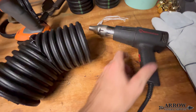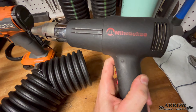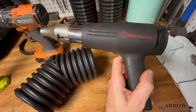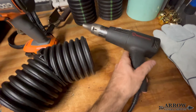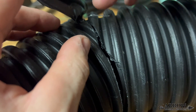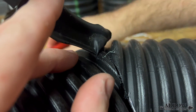I'm going to be using a heat gun with a metal cone on the end to help concentrate the heat into a finer point. That works best when dealing with small four inch dual wall pipe, but the larger the pipe diameter, the larger the heat gun you'll need. For example, if you're working with 12 inch, 18 inch, or 24 inch dual wall, you'll need a larger heat gun. I'm going to trim off the excess wire with some wire snips so it doesn't get in my way as I heat weld.